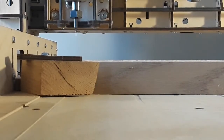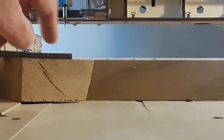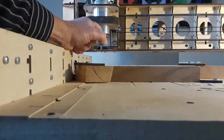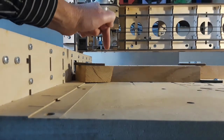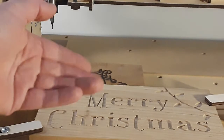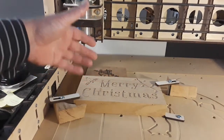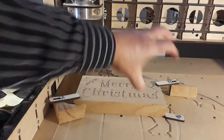The second thing we need to think about is motion in the Z direction. What we have to keep clear is everything from the router bit tip and its width down to the plane within that first envelope we created in our mind. This is particularly important because most programs that generate G-code — the code that actually cuts your work piece — move the tool to a Z position first and then move the tool over to the XY start point. In all my years of machining, I never understood this, because when you have multiple workstations set up, you always want that XY to be over the part before any Z action starts, to make sure you're clear of all your work zones.